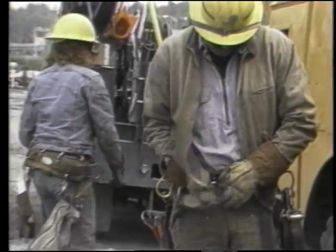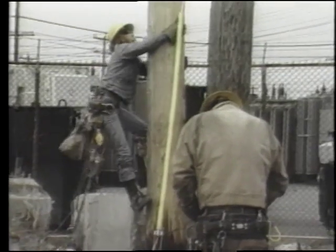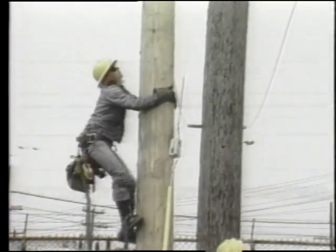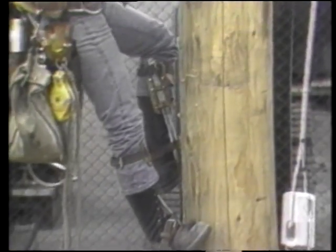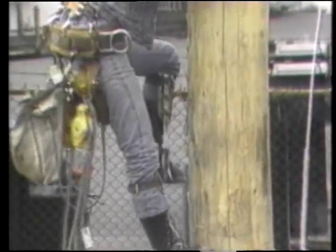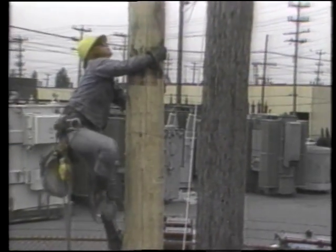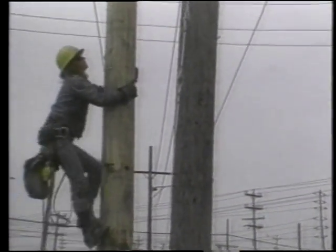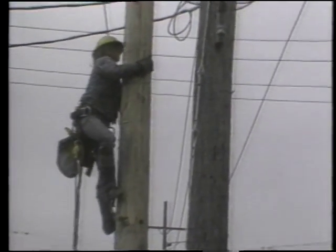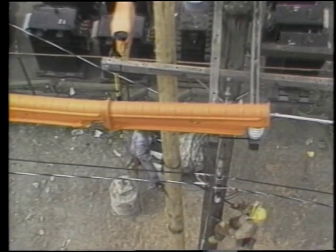The body belt is another important item. The belt weighs about twenty-five pounds without tools and holds tools, the hand line, and the safety strap. She sinks only one quarter of an inch of the hook into the pole when climbing. Notice how her knees actually turn out — line workers say that you develop new muscles to be able to do this work. Once in position, she straps herself to the pole fifty feet in the air. Skill, strength, a safety strap, and a quarter inch of steel is what a line worker depends on at these heights.